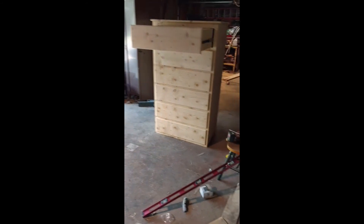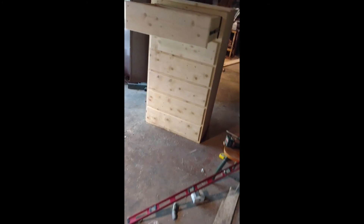I put the slides in — all you have to do is set the drawer in there. I have a 7 and 3/4 inch drawer and an 8 inch gap, so there's about an eighth inch of clearance top and bottom. Set the drawer in, put the slides in — you have to make sure the slides are level and square with each other and square with the drawer. Lay the drawer in there, screw the sides on, and it's just a simple install for the slides.